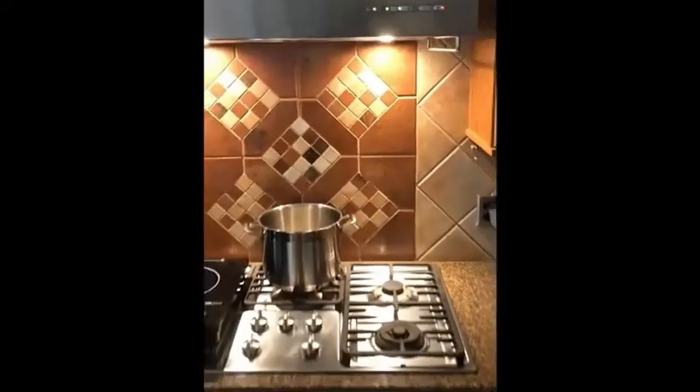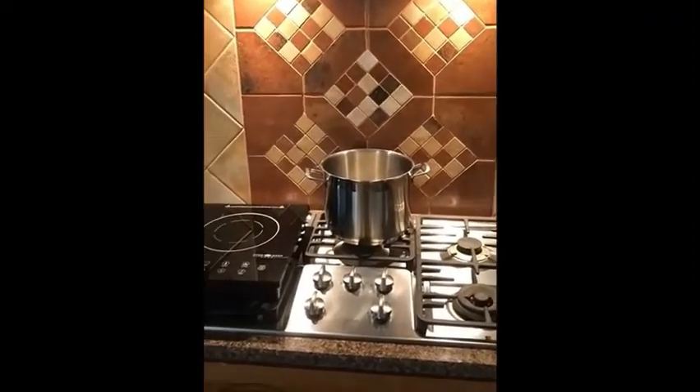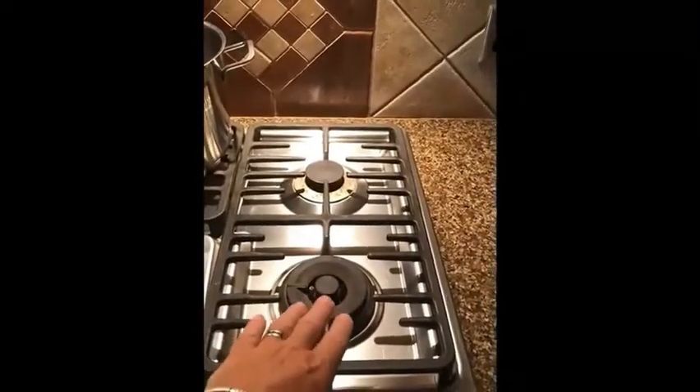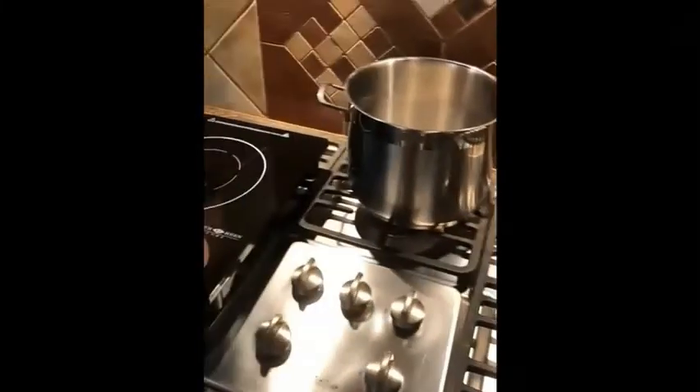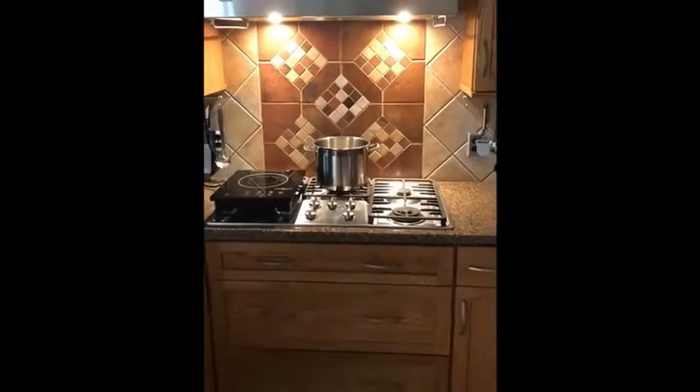On low speed, this might be the preferred setting — just getting rid of moisture and odor from cooking. It may not capture all particulates and combustion gases off the front burners, so it's recommended to use the back burners. But since we're trying to achieve the greatest depressurization possible in this house, I'm going to turn it on high speed. There may be times you need high speed, like if you burn something bad on the stove. And now you can see quite a bit of air is moving out of the house.